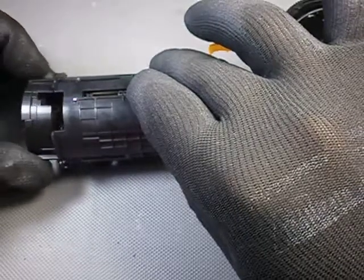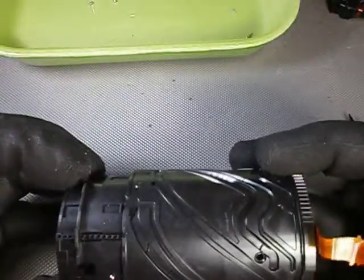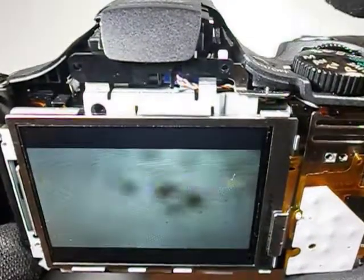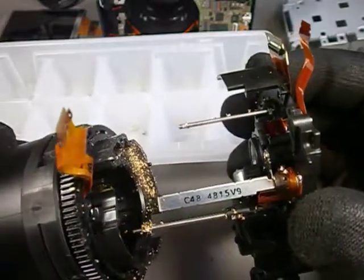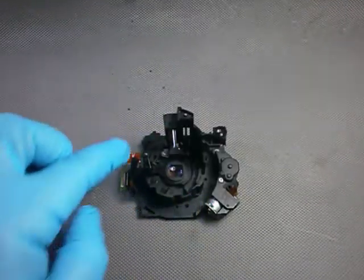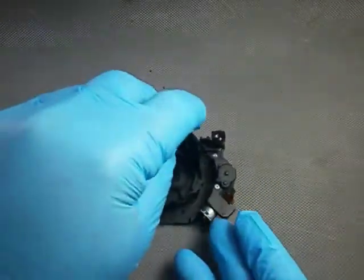In the last episode we learned how to reassemble the optical elements driven by the barrel cam of a Canon SX520HS zoom lens. We had to do that because we detected dirt on the sensor window, indicated by dark spots. When we opened the lens, we found the debris of a real ant nest installed in the camera.